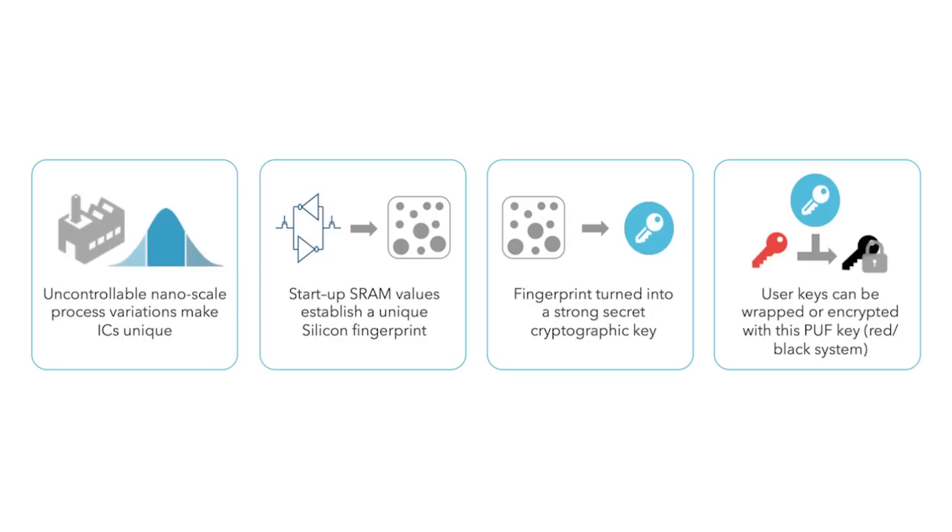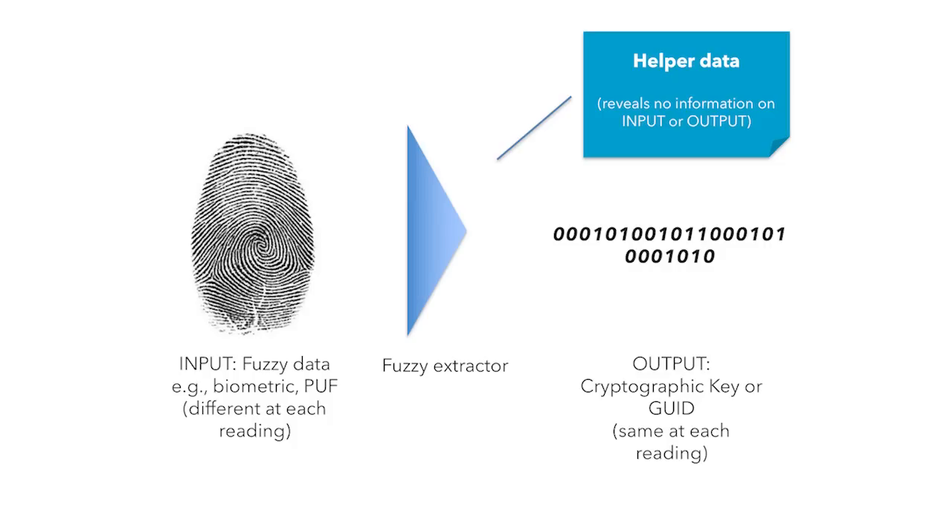The SRAM PUF is an incredibly unique security technology that's being adopted more and more as a hardware root of trust. Because it's a trust that protects so much sensitive data, the fundamental requirements are that it be immutable and able to preserve the unique identity and authenticity of a device down to its most basic levels. Rather than requiring cryptographic keys to be injected into a device during silicon fabrication, SRAM PUFs take advantage of sub-micron process variations in the SRAM transistors themselves that give off a unique signature when powered on. This unique signature can be used to generate truly unclonable functions that provide the basis for root keys, and it filters out noise from the inherently entropic uninitialized SRAM signal to create intrinsic PUF keys that are never actually stored — just reconstructed on-demand using that SRAM's unique fingerprint.